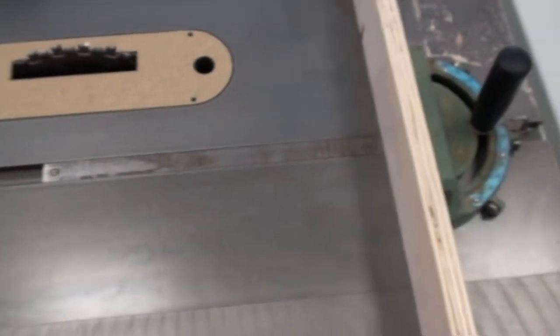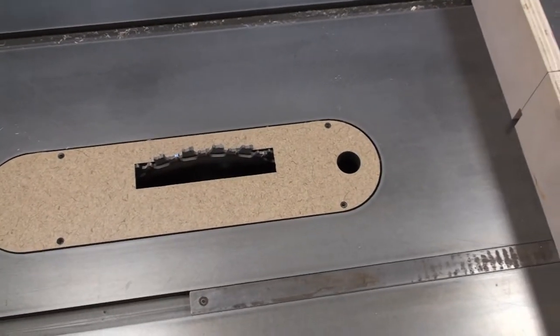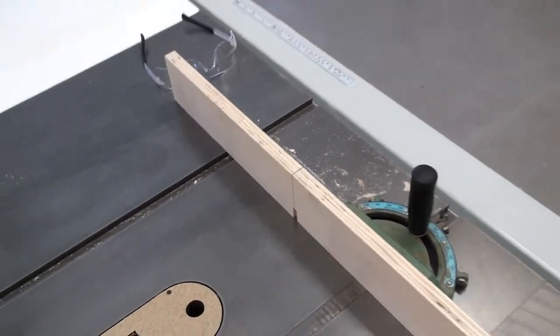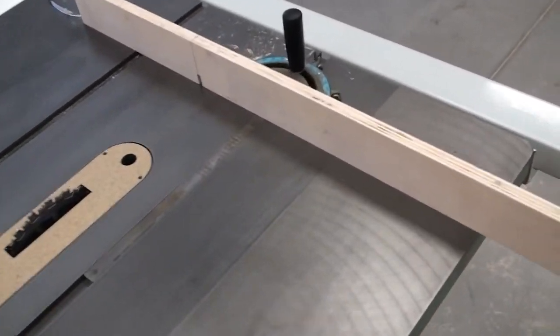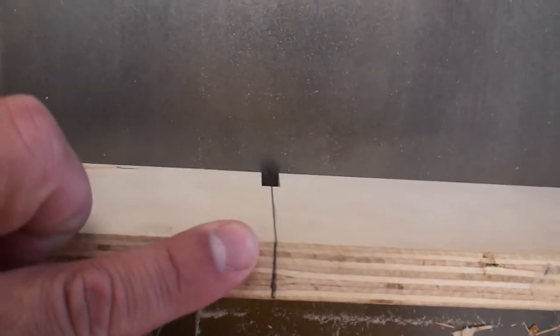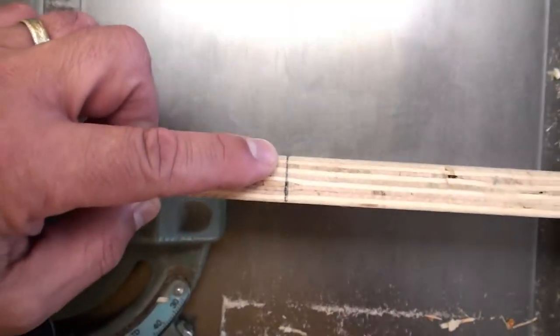And I went and measured the height. I wanted to come up about 3/4 inch, which is the width of the bar on those bar clamps. And then I put a sacrificial fence onto my right angle gauge here, and I made a center mark right on the gauge where the groove that my stacked dado head cutter is going to make will actually happen.